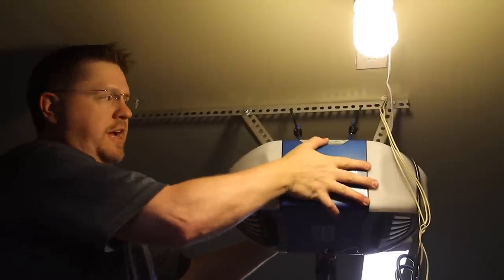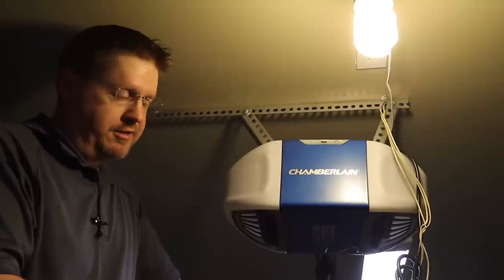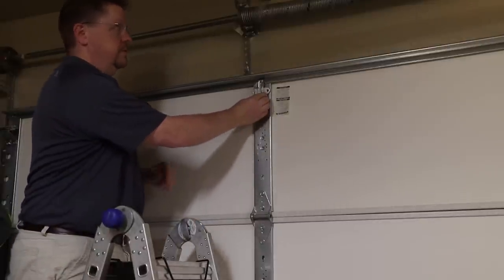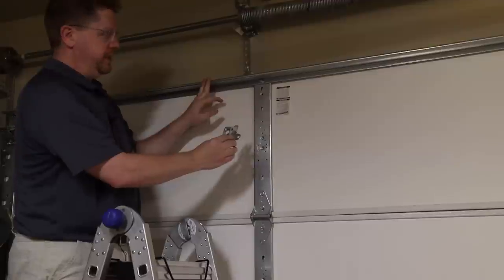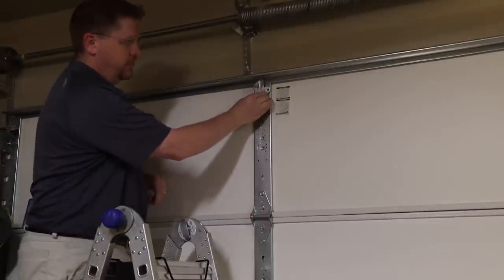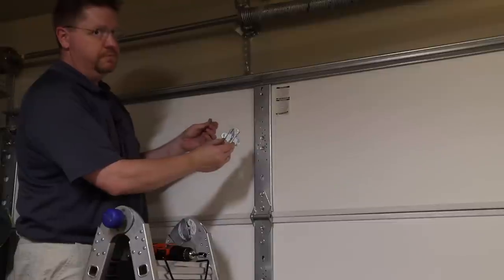Now that it's solidly attached, don't plug it in yet — you've got to do all your wiring first. Up next, install the bracket that goes on the door. This door already has a horizontal support piece with a bolt in exactly the correct spot for where we want the top hole to line up, so we'll use that to locate our other holes. The bracket has an 'up' marking, so make sure you put it facing up.